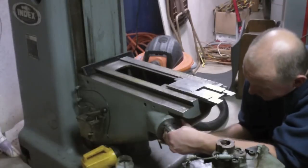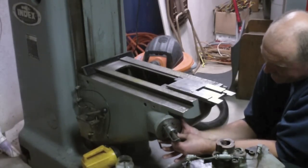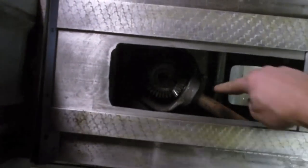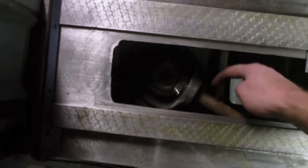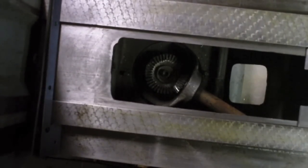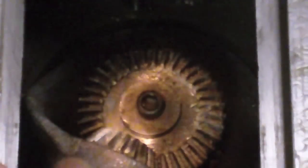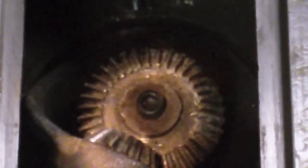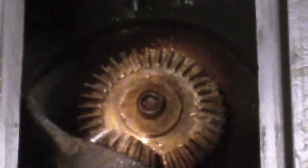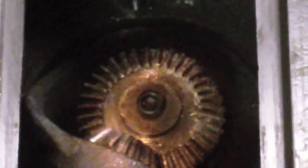Alright, I think I can cheat here — all it takes is one to get started. I've got a problem. The other night I reinstalled this shaft. I know that the Woodruff key stayed put, so that's good. The problem is you can see there's a little bit of space there — this shaft needs to go in a little further, but I can't push it any further the way it is. What's likely happening is this pinion gear was being pushed that way as I was driving the shaft. With this pinion gear being pushed out too far, it's meshing too tightly with the teeth on the other bevel gear, and that will cause excessive premature wear of those teeth. So I've got to back that out — but not too far, because that will create excessive backlash in the knee adjustment.